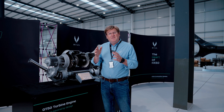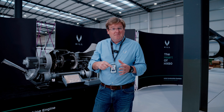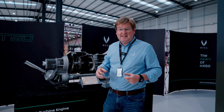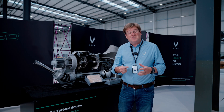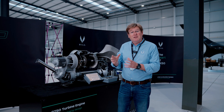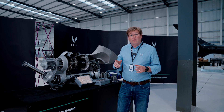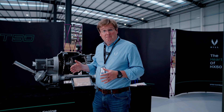What we have to do is develop the means to control the flow of liquid metal into the mold, keep it as smooth and orderly as possible. Any bifilms, any defects, any entrainment of the mold material that happens during the filling process has to be captured by features we build into our casting process. Over the last couple of weeks we've been working through each of those steps to enable us to test the first production-worthy GT50 turbine blades.